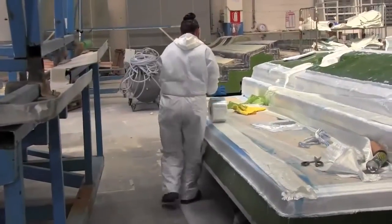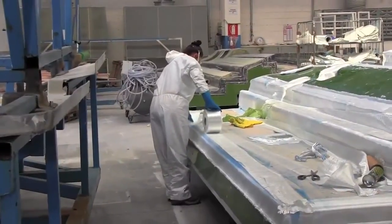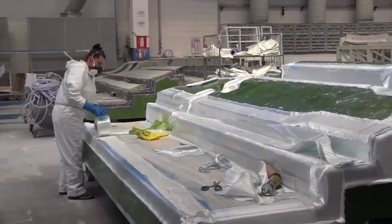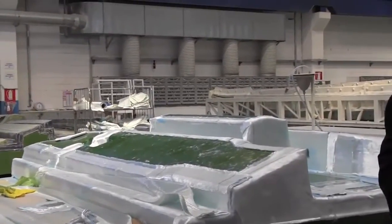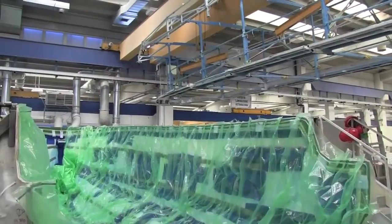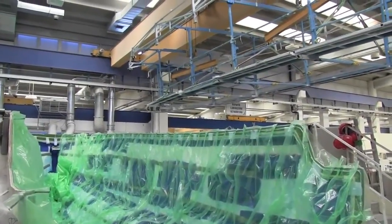A regular lamination consists of a manual process. You stack all the different plies of fiberglass with different orientations — whatever orientation you need to achieve a certain performance. You stack one layer of fiberglass, laminate it manually, dispose the resin manually, then stack another layer, apply resin again, and so on up to the full stack that you want.